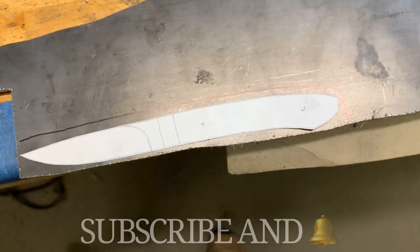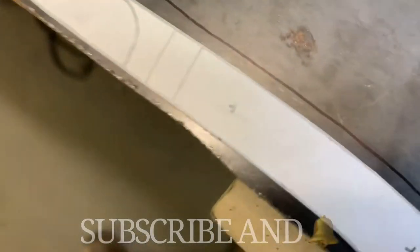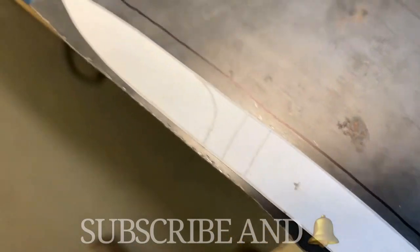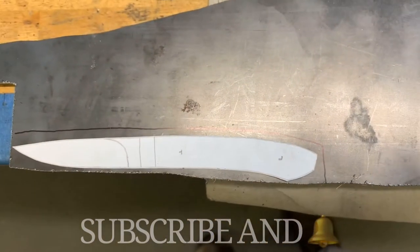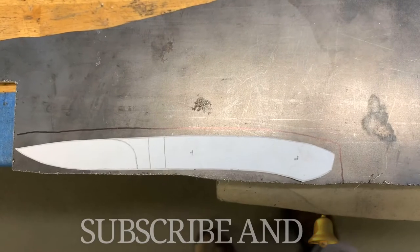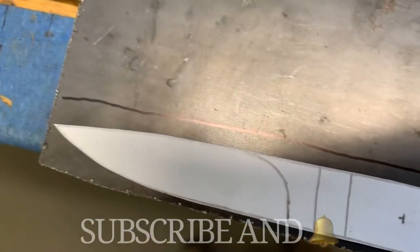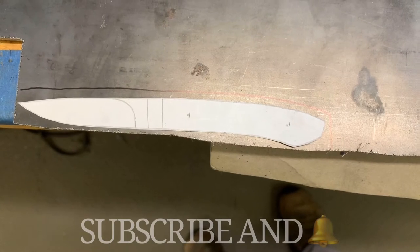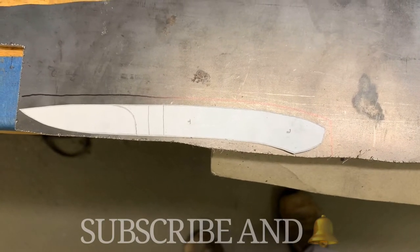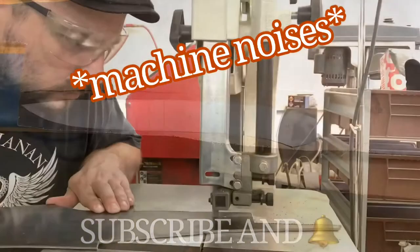I've drawn up this paper pattern where I want the bolt holes, guard, blade length and handle length, profile and all of that. Then I've taken this mild steel, drawn a nice black line, giving myself plenty of room around the outside. I'll go ahead to the bandsaw and cut along that line so I have some smaller piece of material to work with to make my pattern out of.